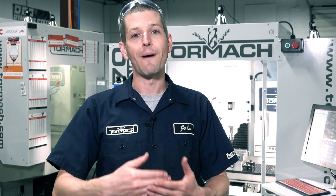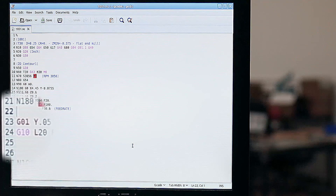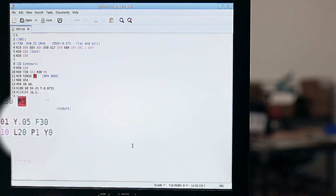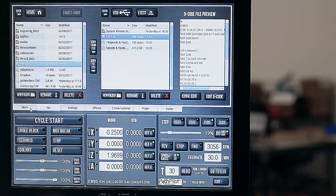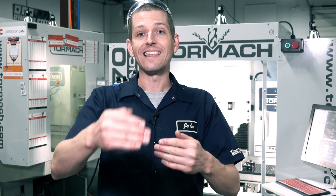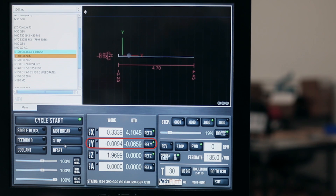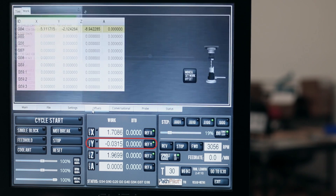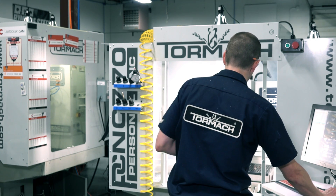It's such a pain to keep having to update PathPilot — I wanted it done automatically. How do we do that? G10 L20 P1 Y0. It's a PathPilot or LinuxCNC thing that will automatically update your work coordinate system. We added some code to the end of a Fusion 360 2D contour that walks across the part, and at the end it moves to Y positive 0.05 — so 50 thou width of cut. When it's at that location, G10 P1 (which is for G54, that work offset) sets the current location to Y0. Now I can just keep hitting cycle start and every time it reruns the pass it's moved back 50 thou, so I don't have to carry the mental burden of tracking my coordinate system.